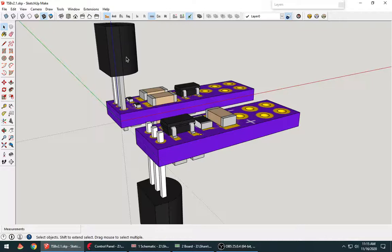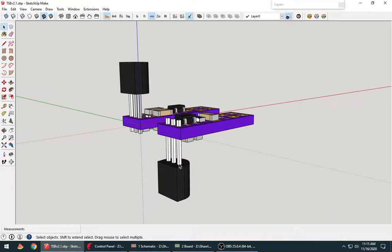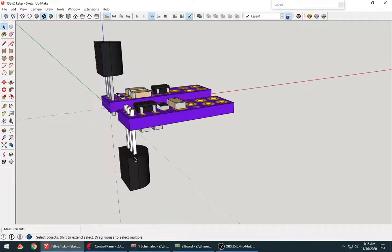PTC or whatever, the positive temperature coefficient. So as the temperature goes up, the voltage goes up. And this one, it's NTC, like negative temperature coefficient. So as the temperature goes high, the voltage goes low. So the logic and the calculation, there's a calculation for it. This was much simpler. Just whatever millivolts you read, subtract 500 and divide by 10. So it's 10 millivolts, 500 is 0 Celsius, and it's 10 millivolts per Celsius degree. This one is a little bit more calculation, but it's going to be done on the server, so it's not a big deal.